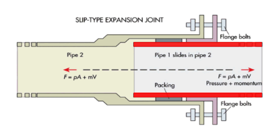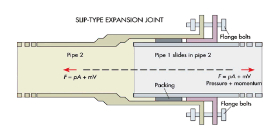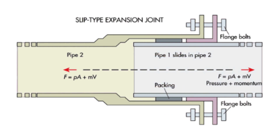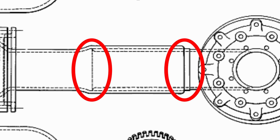There's a pipe of smaller diameter that sits inside a pipe of larger diameter. Sealing the two is something called gland — it's essentially a tightly packed, movable gasket. There's also a good amount of lubrication between these pipes and infused in the gland. This is because if there was so much as a scratch down the length of one of the moving surfaces, the pressurized steam would start to escape.